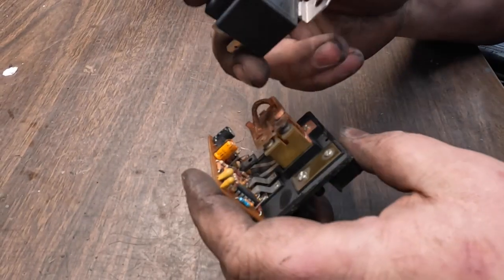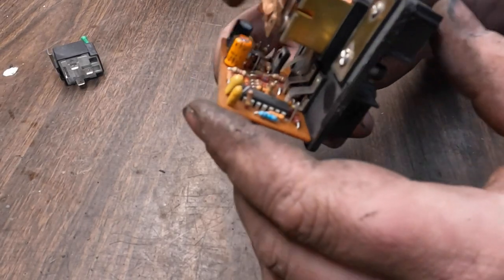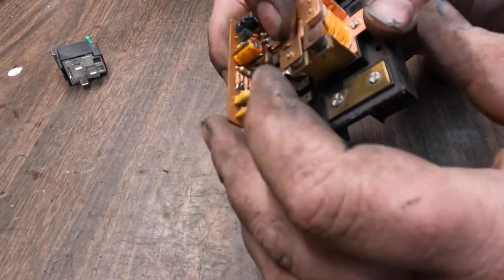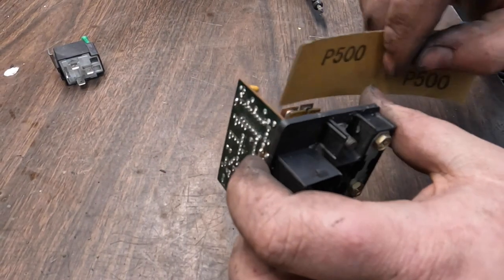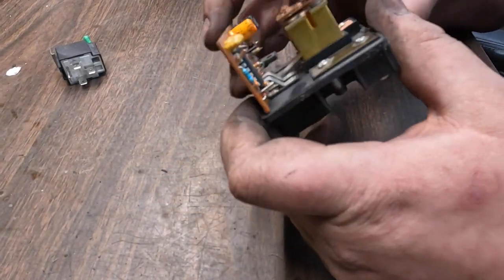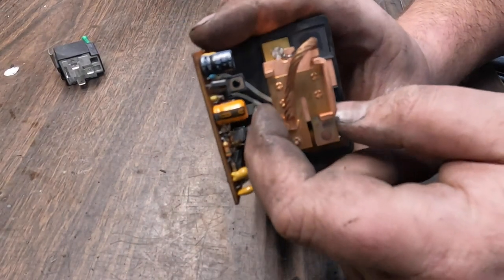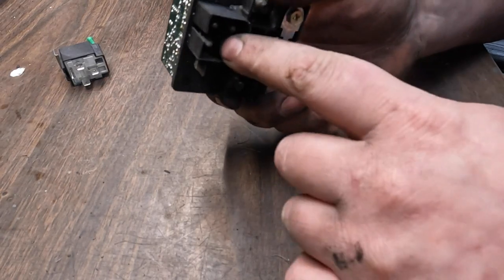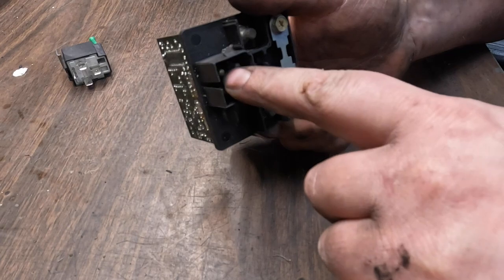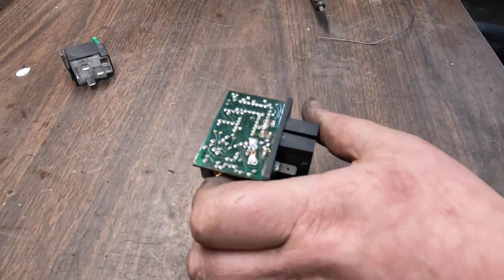So this little nugget is just one big relay. You're probably used to seeing them like this, but it's all the same — it's just a little bigger. I can see a little heat discoloration from only using one of the contacts, so I poked and prodded at them so they both seem to click down at just about the right time. Also polished them with some 500 grit. To get this thing to stop thinking on its own, all I've got to do is get rid of this circuit board and take two control wires, using these original contacts and connector.